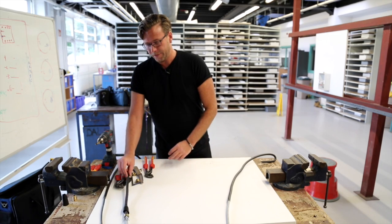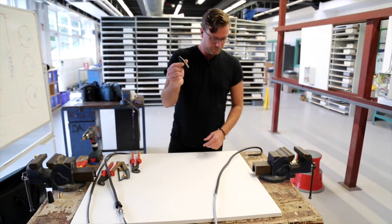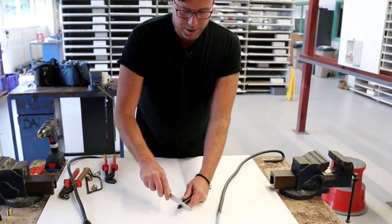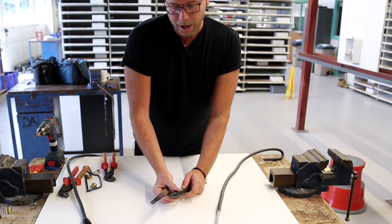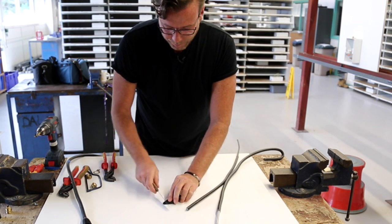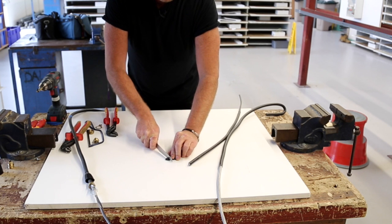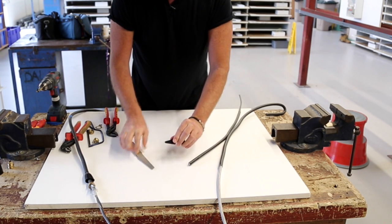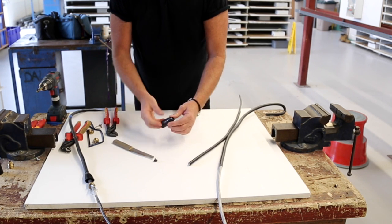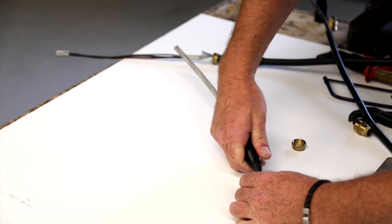With the use of a knife, we take our shroud and we take the top off the shroud. Judge the distance by putting the shroud the opposite way over the armoring and basically marking it, then use the knife to cut the end off like so. Then we can slip our shroud onto our SWA — you see a nice tight fit there.